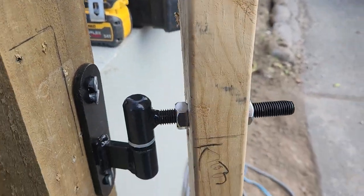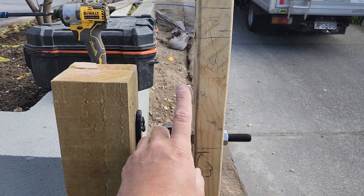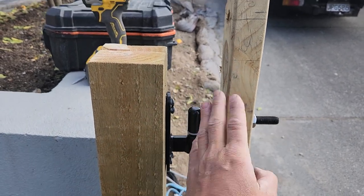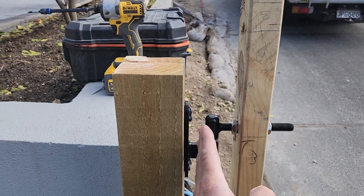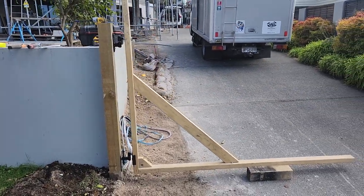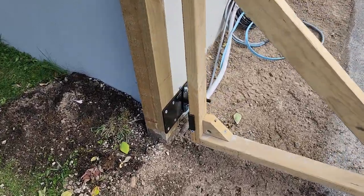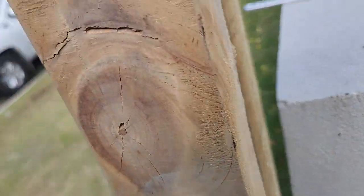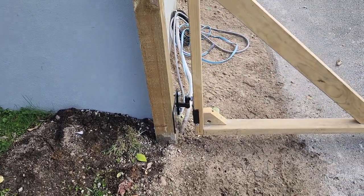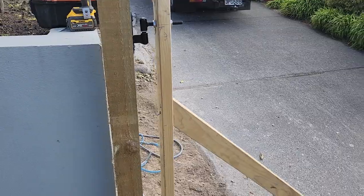With this gate, it's actually going to have timber on it. The gate frame is going to overlap the frame, so we'll only have a 20 mil hinge gap here instead of an 80, unless the customer doesn't mind an 80. But yeah, that's a basic rundown of this rising hinge set. Hit like and subscribe if you're a fencer — say hi if you're a gate builder or DIYer, feel free to ask questions. Have a great day, catch you later.